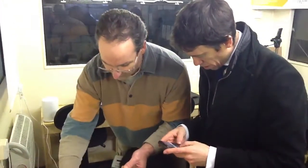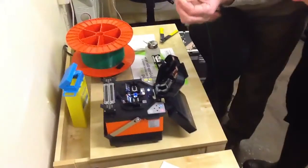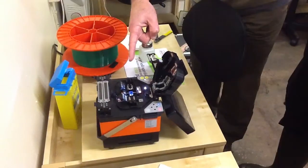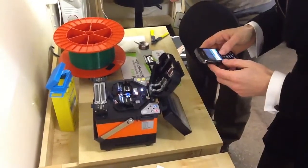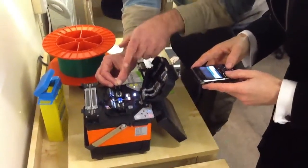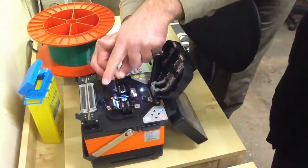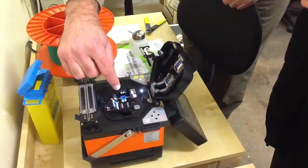So what we've got to do now is get that into this machine. Are you happy putting the fibre in the left hand or the right hand? Because you're going to find that tricky at first. Left hand — okay, I'll do the right hand one then. When I put this in, I want to lay it in without touching the end, because at the moment that end will be clean. I need to lay it in roughly between those two pointed electrodes — and then this is the fusing. I'm just going to do the fusing. Clamp it — it's just a little bit to the right of the two electrodes.